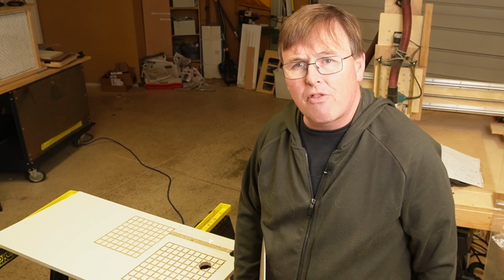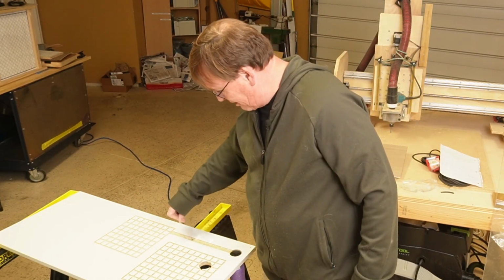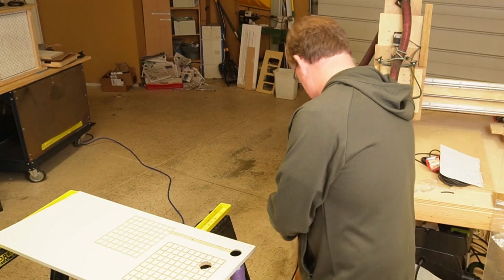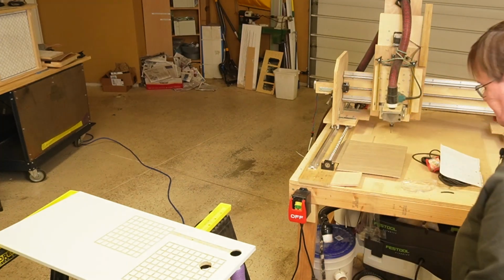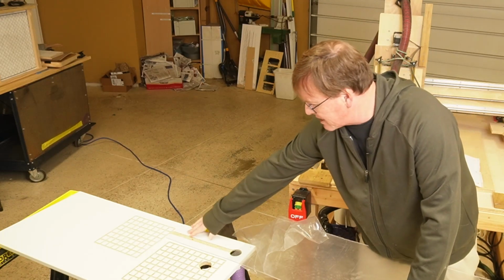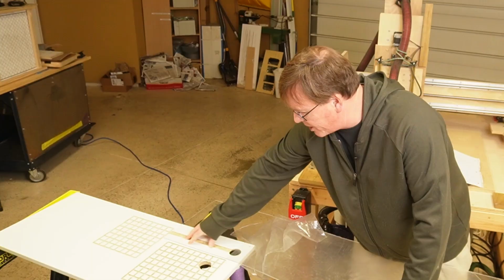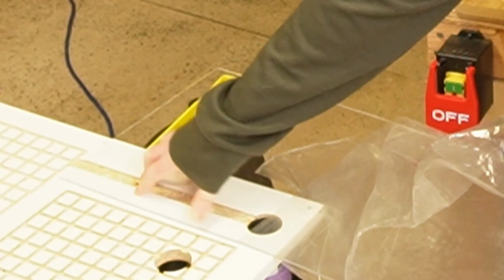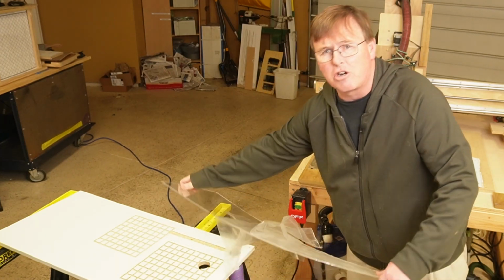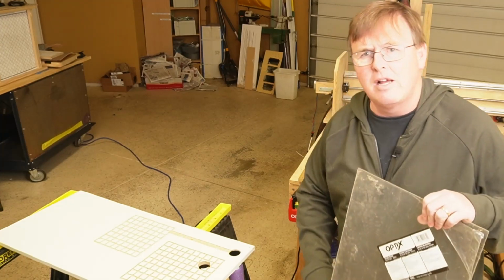Now, is there one more thing that we could do besides this strapping tape? If you think this is ugly, which I don't think it's horrible, here's another thing you can do. Get a small piece of plexiglass and go ahead and hot glue it down on the surface over the top of your channel. Make sure there's no leaks along there, and then just take maybe an inch or two of the packing tape to finish off the channel and fix it to your board so you get a nice seal. And I hope that's all helpful.